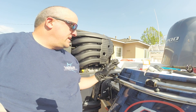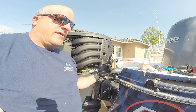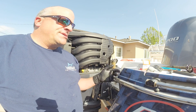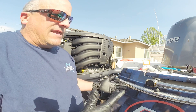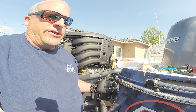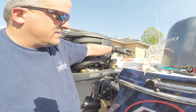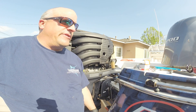I'm not going to show the fuel water separator because it's below deck, but it's basically the same process: unscrew it with the filter wrench, be careful not to dump all the gas out, maybe have a bucket down there, and finger-tighten the new one on. I'm going to remount this to the motor, and that is pretty much the end of the 100-hour service.